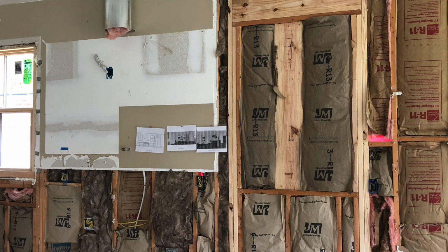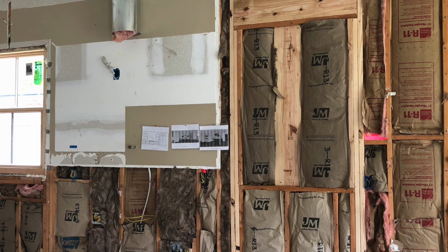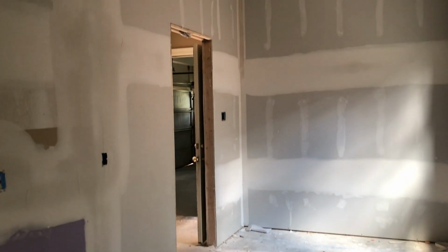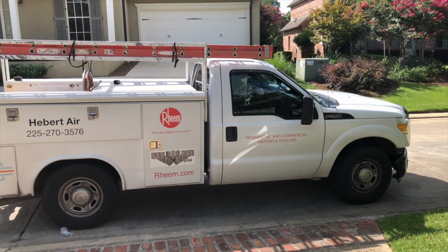You have to prepare for your insulation team to come in and insulate any new walls, especially if they're exterior walls. You have to make sure, like if we were replacing every single window in the house, which we did, all of those windows had to be insulated as well. And all of that had to happen before we had our drywallers come in. Things like this change with the laundry room made it essential for us to have conversations very early on about HVAC. Did we have the power and the unit sizes that we needed to heat and cool the expanding square footage of this house? So electrical and plumbing rough work happens.